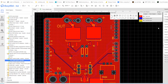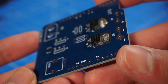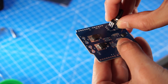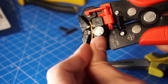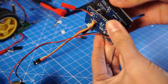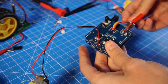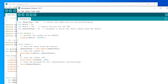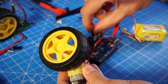Let's start simple and use this PCB that I designed myself using just two MOSFET transistors. Having the board in hand I'm going to solder all the components to test it. This circuit includes a linear voltage regulator and an optional potentiometer, which can be used to control the speed or power of any load from the board itself. I'll connect the wires to the receiver, and because this board is an Arduino shield I'll plug it on top of the Arduino. I modify the example code called Analog Input from the Arduino IDE, upload it, and test it — and that's the result.